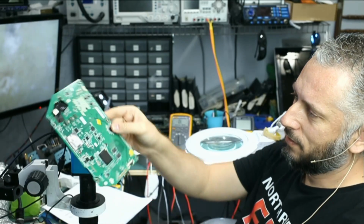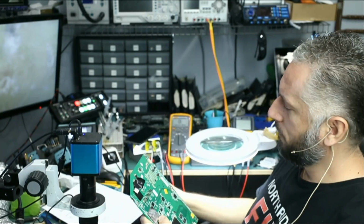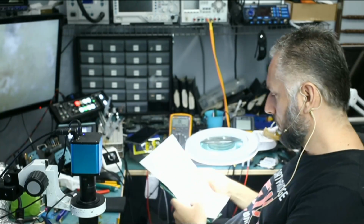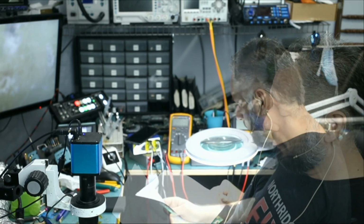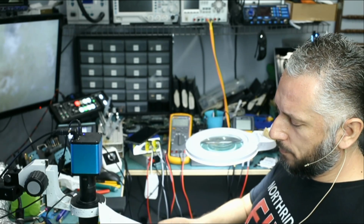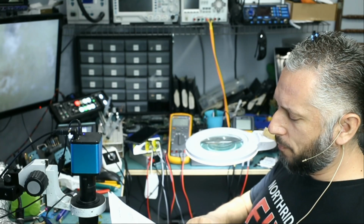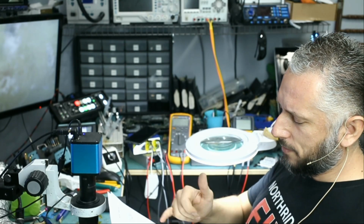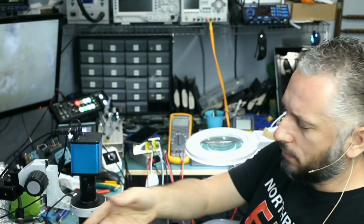And Lyric also mailed over a device to be fixed. And the device looks something like this. He mailed over a motherboard with a connector. And it looks like the Thunderbolt port was broken. He attempted to replace it and he knocked off 4 pads by accident. You want to see if we can try to save it. Let's take a look at the board.